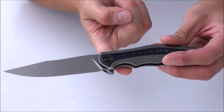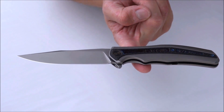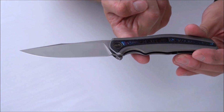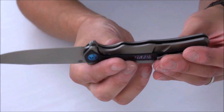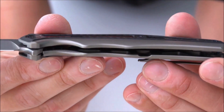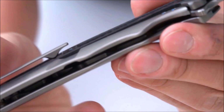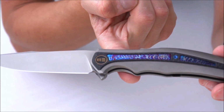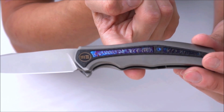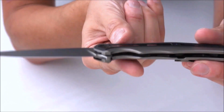Anyways, maybe I want to check the balance point, since I mentioned the knife was so light, but still it is back heavy. So I think with a 4mm thick blade, it would have balanced better. There is quite a bit of internal milling here actually, and that was perhaps not necessary, since the blade, well, but wait, that was of course necessary. The knife is back heavy, so without internal milling, the balance point would have been even further back here. So yeah, I totally get the milling.